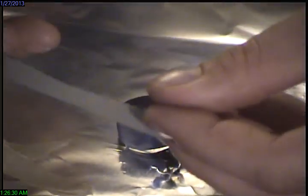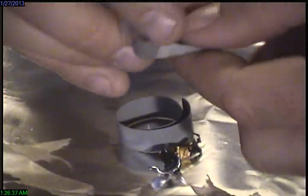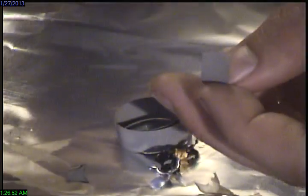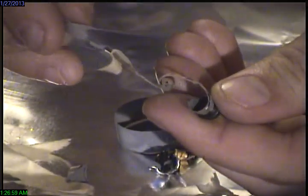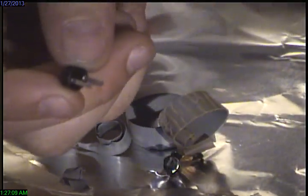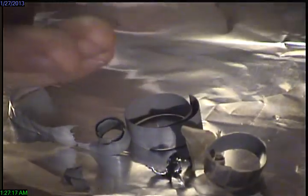They probably deposited aluminum with like a chemical vapor deposition. But this strip is metal on both sides, and I guess it's got a plastic substrate because this tail end here is plastic, or this could just be tape. No, this is just metal. It's no special substrate. This is tape wrapped around the end. That's the tail, and then there it goes. That's all it is. And there's the two posts. I guess they're like spot welded. And that's it. That's how it goes.